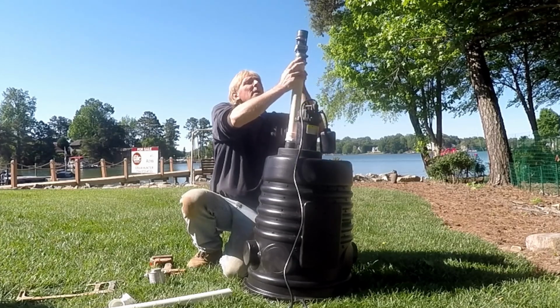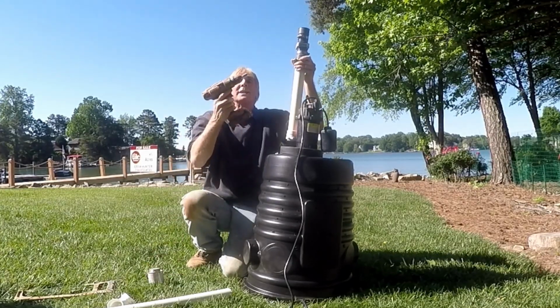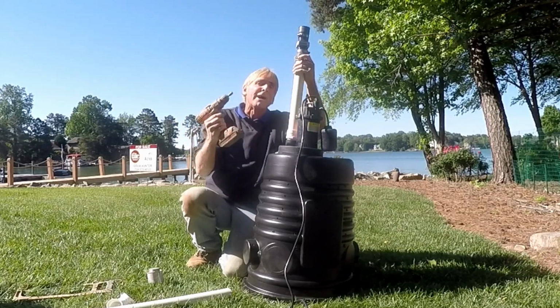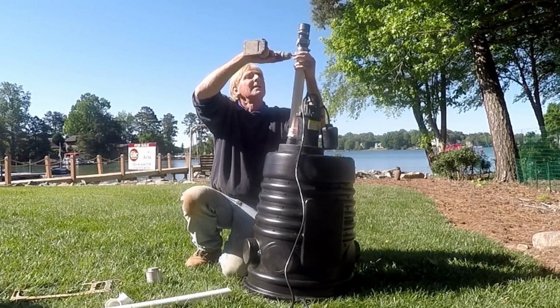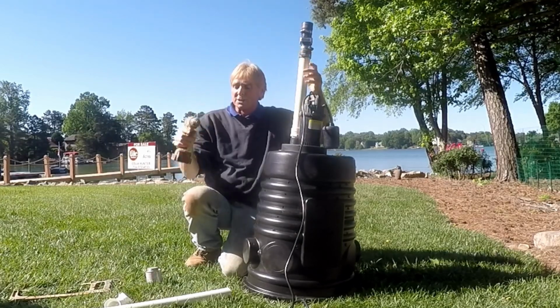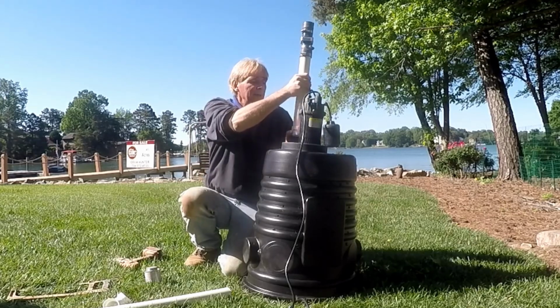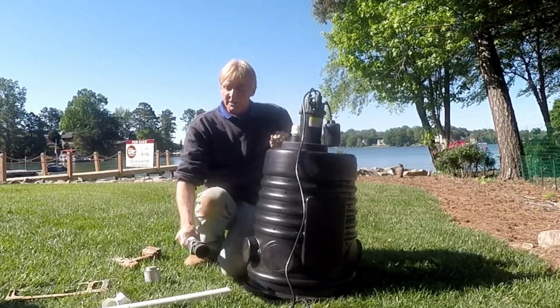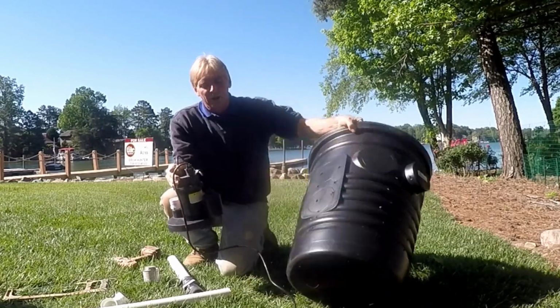We're going to put on the first stainless steel clamp, put on the check valve, slide your clamp back in place using your handy dandy Black & Decker drill with a 5/16" bit. You go ahead and secure that just as tight as your drill can make it. Now we're ready to go ahead and glue this up. So let's just check it and make sure.